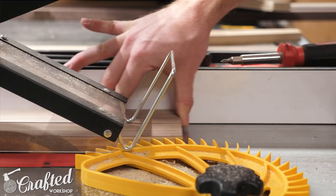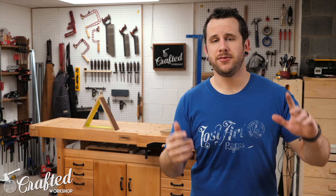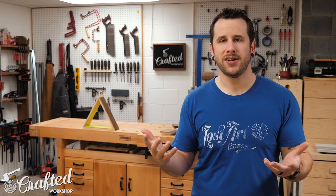After getting your materials, you need to cut the angles. There are a handful of ways to do this. I use the miter saw, which I think is probably the easiest way. But if you don't have a miter saw, you could use your table saw with a miter gauge, a circular saw, or even a hand saw and a little miter box and come out with some pretty clean pieces. The angle you need to cut on both ends of all these pieces is 30 degrees, so set whatever saw you're gonna use to 30 degrees and get to cutting.